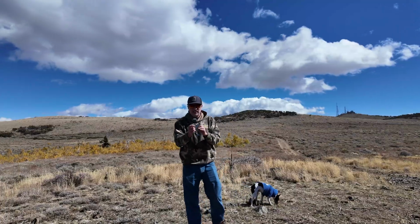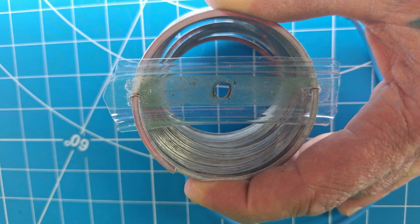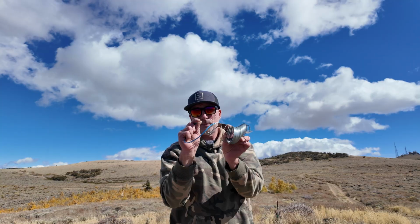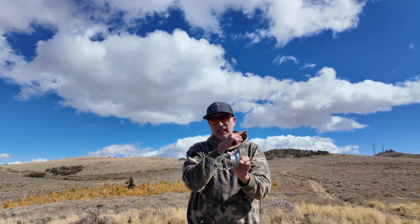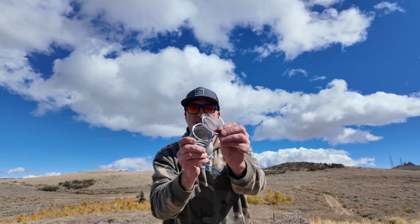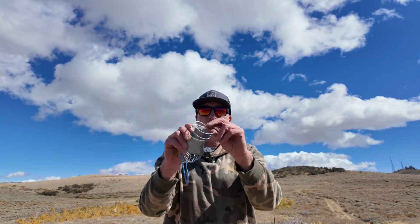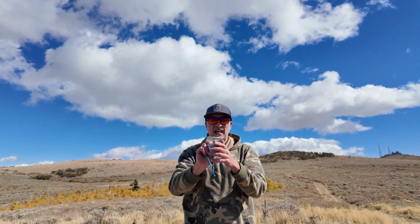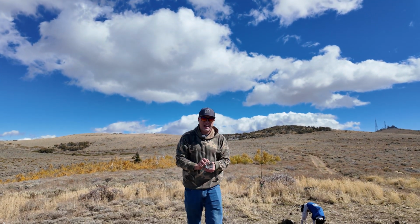Okay, let me show you my Slinky up a little bit closer. I forgot to show you the other end. So on the bottom of the Slinky, I soldered two of the rings together, and then I have a lead wire coming off with this spade connector, and that's going to connect to my 9-to-1. And then there is that plastic top you see that spreads over two of the wires evenly, and the hole in the middle. So this is going to slide over my mast.